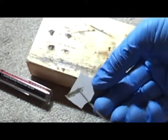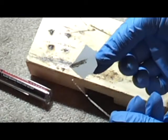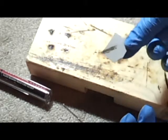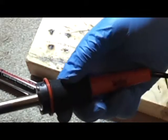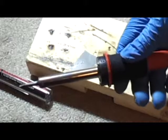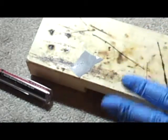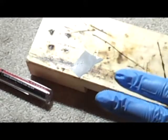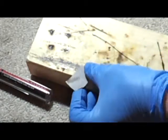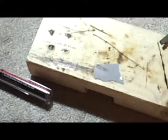This has been my dilemma for the past two nights and about five solar cells that I've fried — the cells are useless to me now, so I just used them as training. I've looked at 80-watt temperature-controlled soldering irons and they're about $300. I'm not spending $300 on a soldering iron. I've found that this works best: take your time, go slow, don't overheat, don't keep your tip on there too long, because once that silver is gone your cell is useless. I'll clean the rosin off and show you what I mean.